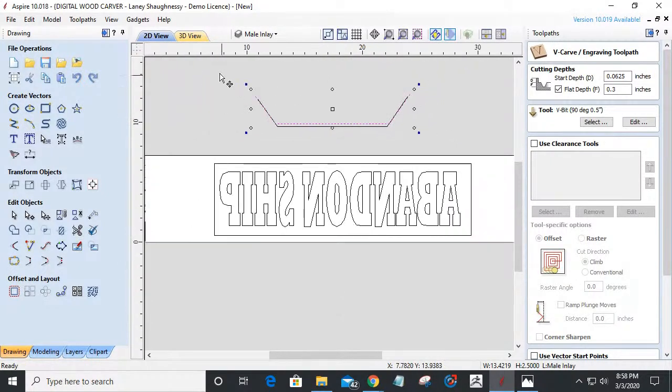So what my goal is, I got to equal 0.3, no matter what, 0.3 from that 16th of an inch. So I'm going to add into this 16th because I got to start there anyway. That's what my little pocket is. I'm going to add in 0.28 to that. That's where I'm going to start. And then I'm going to finish 0.02. 0.28 plus 0.02 equals 0.3. The 16th of an inch, I have to start that there because I've already pocketed down a 16th.